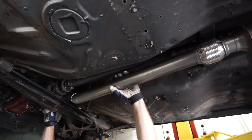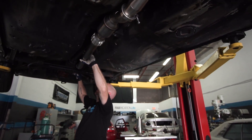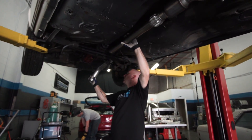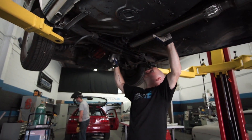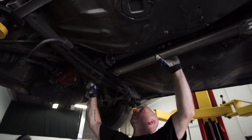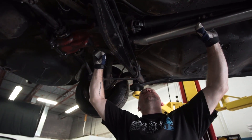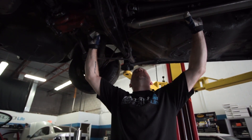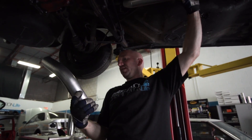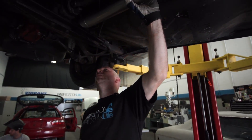I'm going to want to add a flange joint right at this point or somewhere close to it, because I need to be able to fish this end over it. I don't want it too long because otherwise I won't be able to feed this pipe through to make that connection. I think that's a pretty good spot for it, right between there. I might have to cut this leg a little bit shorter on my 60-degree, but I think that should work.